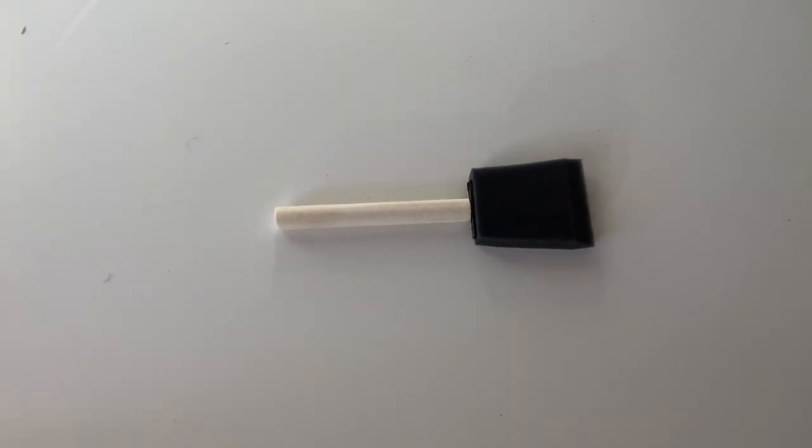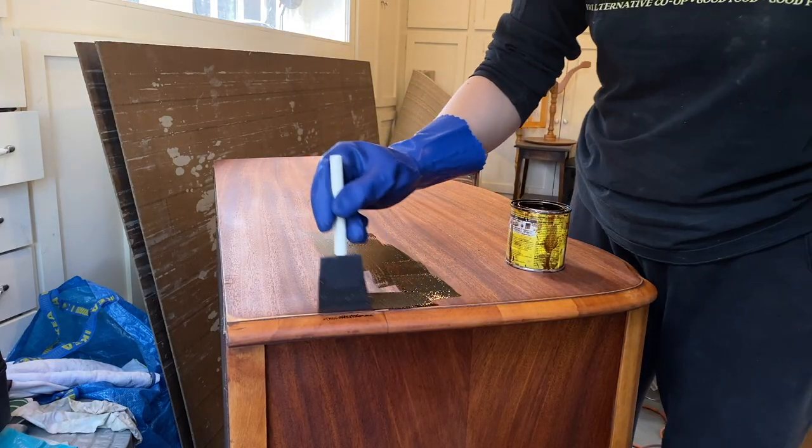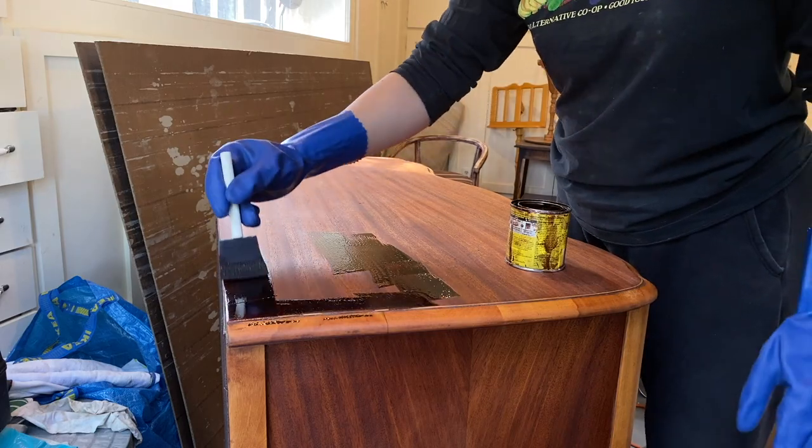I'm gonna start here with the cheapest product. This is a foam brush. These usually cost about $1 at the hardware store, although I've linked everything down in the description below so you can purchase off Amazon if that's easier for you. These are great. I love using these for stains, for top coats like polycrylic and polyurethane. They have such a nice smooth finish and do not leave brush strokes.